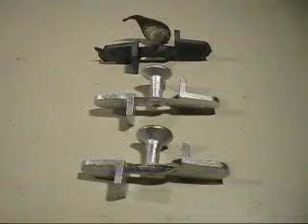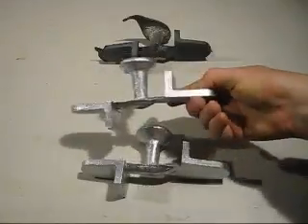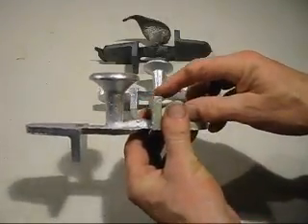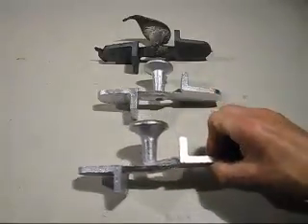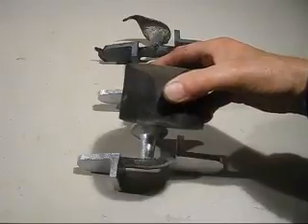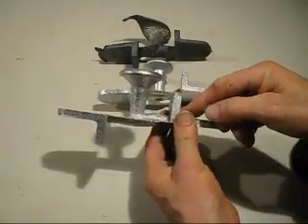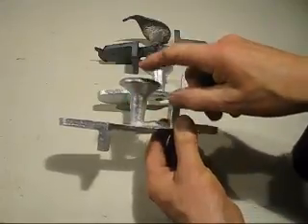Here is a closer look at the results. As you can see there's not much distance between the sprue and the casting. Just because aluminium is lighter, it does not need extended sprues or risers to fill up or feed the mould. What will change is when castings become larger and thicker — you need to increase the diameter, not the height.